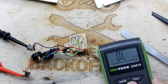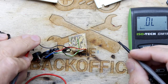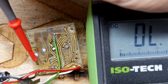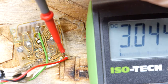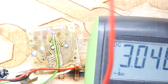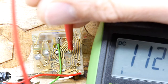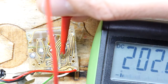It's going to be that kind of manual effort now — just going through from the power and seeing what we've got at any point. Let's put our probes the right way around so we can get something sensible. We should be getting three volts here — and we do, look, we do get three volts there. Although it is a bit twitchy, it's not a nice clean three volts. On our crystals — two volts there, 1.1 volts, again two volts there. So we're getting power at some of the circuits; there does seem to be some corrosion there but I don't think it's a particular problem.